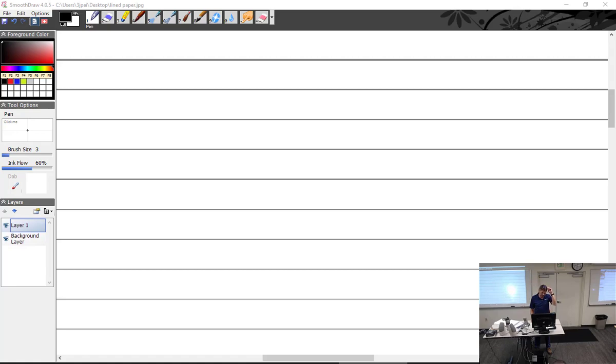All right, moving on from metal props. Well, the one thing I didn't mention about metal props is all the damage you get to the tips of the metal props along the leading edge. It's just really common. You can run your fingernail down it and kind of catch it, and that's not good. Every time you have even the slightest blemish along that trailing or leading edge, you're creating a stress riser where the propeller could crack and that piece could break off. So that's a really, really bad thing to have happen. So you never want to ignore any sort of rock chip or anything that you can catch your fingernail in. It's got to be, I think, addressed immediately.